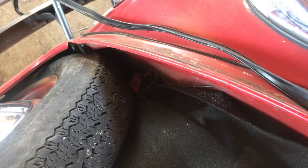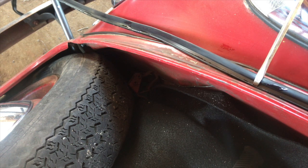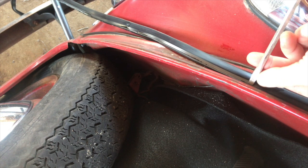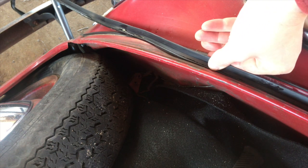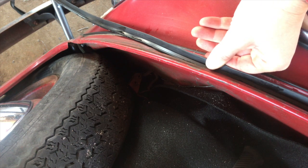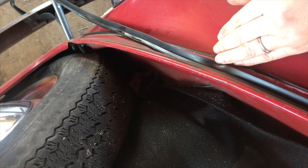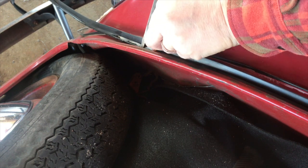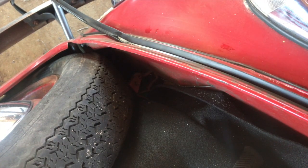Sometimes you have to get a flat straight edge, or you can pull this lip up just a little bit more. I like to follow the same method - you don't want to make it fatter, so you want to pull with your hand to make it skinnier and then shove it up. Take the lip that's sticking up, pull down on it - that makes this ridge line just a little bit skinnier and it's real easy to then push up with a straight edge and slide it in. This one's actually going in pretty easy.